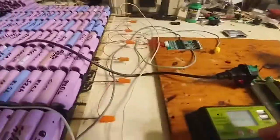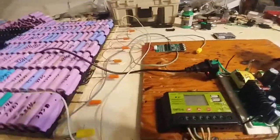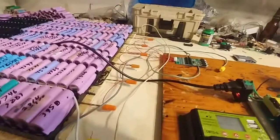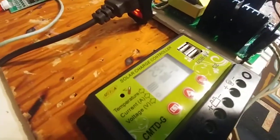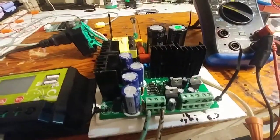I'm going to go off of these two for the solar panel — 36.5. I've got a lot of little guys, so I could probably build another wall just with bad batteries. And because it's parallel with this one, they act independently when the BMS is hooked up. So you can have one wall of really crappy batteries and one of really good ones. And as you get more good batteries, you can get enough and then swap out the whole unit. If anyone lives in Ontario and wants to buy some low-end batteries for some kind of project, let me know.